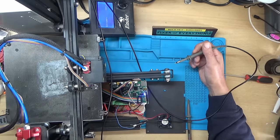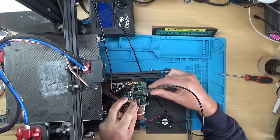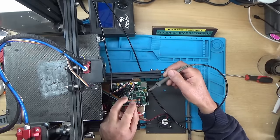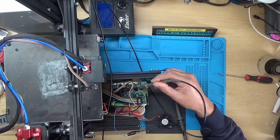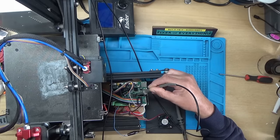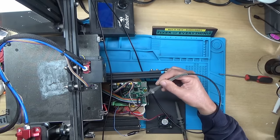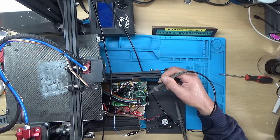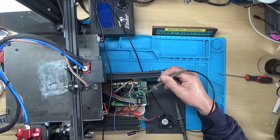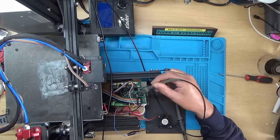I'm not sure what's going on. It's like the microcontroller isn't sending the signals to tell the stepper driver to move. It could be that the stepper driver blew and sent voltage back down those two lines and damaged the microcontroller — that's a possibility. But I'm also wondering whether it could be a problem with the firmware or some setting. I'll try reflashing the firmware back to stock and see if that makes any difference — and if not, it must be the main microcontroller.